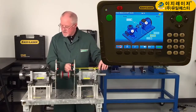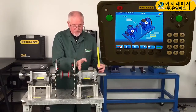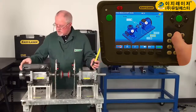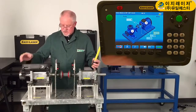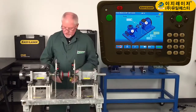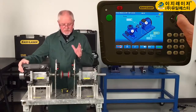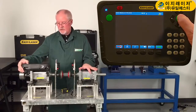It says M to MF1, which is movable foot 1 — movable machine foot 1. I've got 2 and a quarter, so 2.2, enter. And the last measurement is the distance between the machine's feet, which is 6 inches. Now I have everything that I need in order for the machine to take some readings and then calculate how much shim we're going to have to put underneath.